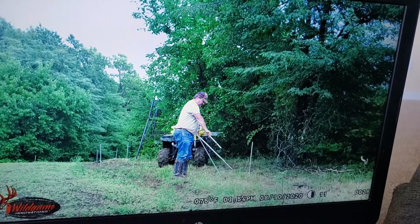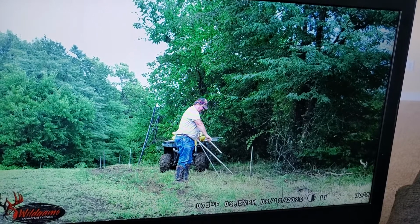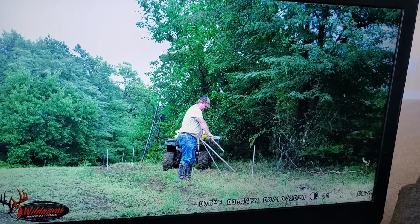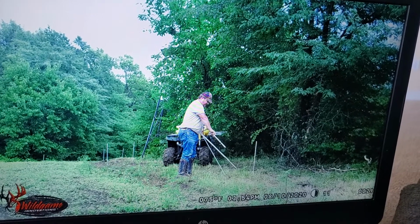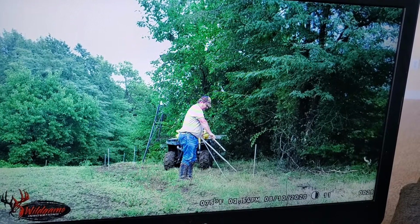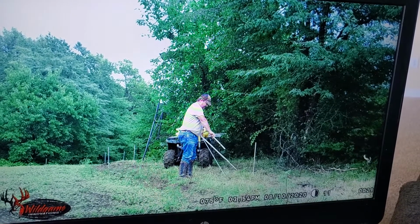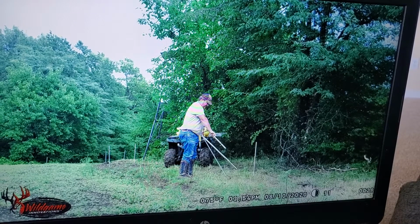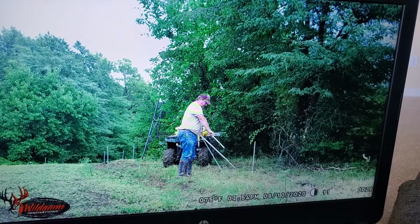And I have the S40. And there's two settings on there. You can turn it on wildlife mode, which pulses faster at nighttime and slower during the daytime when the wildlife's not moving as much. Or you can turn on livestock mode, which pulses faster during the daytime when the livestock's more active and slower at nighttime. And with the photocell on there, it'll last 3 days without any sunshine.